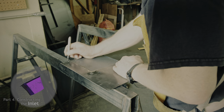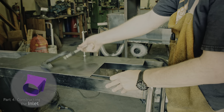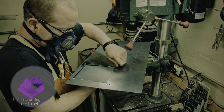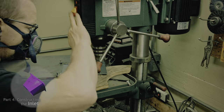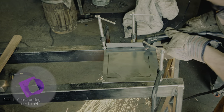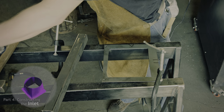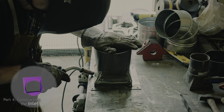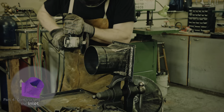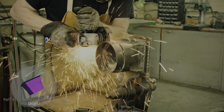The remaining work for the inlet is a base plate that I can attach to the metal dust collector with screws. The plasma cutter is handy to just quickly cut it out. I am using a piece of straight steel to guide the cut, which is definitely better than my wobbly hands. I am using the existing cover to place the screw holes and will drill those with the cover in place as a template. At least the holes should match up then. Now I just need to cut away the inside — yes, the plasma cutter will do that for me again — and then weld the base plate to the inlet and voila, inlet is ready for action. It is interesting that I can get away with so much inaccuracy. On the other hand, it also makes this project very forgiving and means that in my limited time I can make steady progress. The inlet is a little bit long and I am cutting it to a shorter length with a cutting disc so it will not stick out too much from the dust collector, but will still leave me enough room to connect pipes.